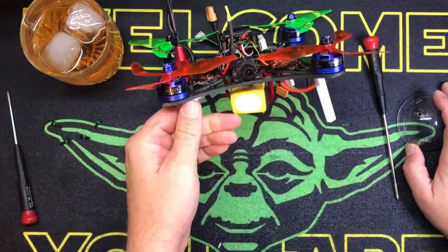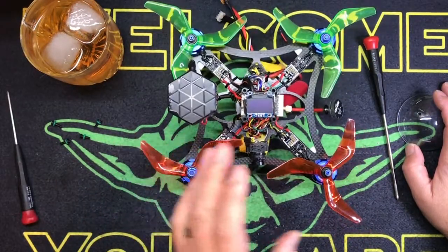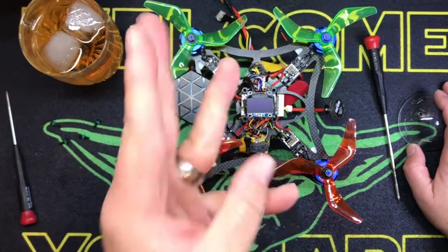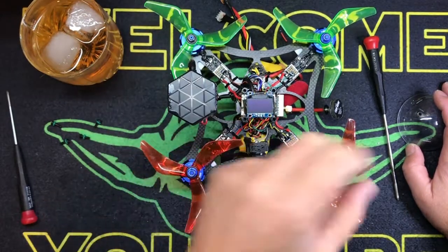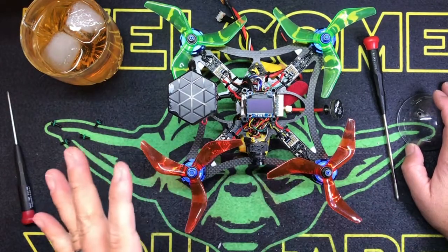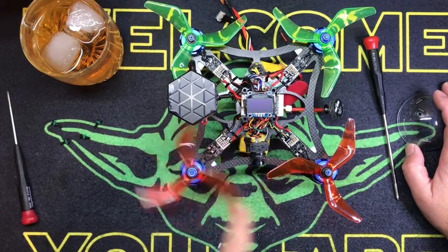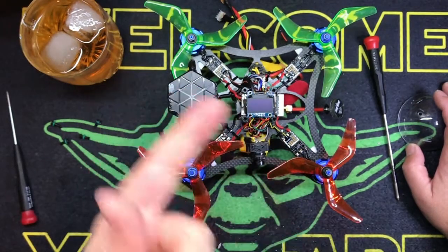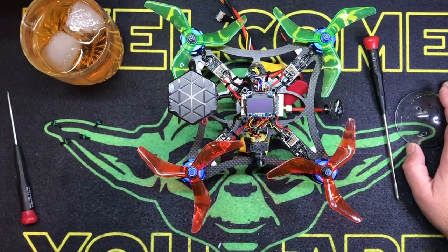He's not the most efficient drone for flight time. But that's okay because EWAD, which stands for Extreme Weather Aerial Drone, I built so he can fly through snow, rain, and high winds. He has high KV, 2600 KV motors, 5-inch props. He can slice through about anything. In that video I did the other day where I went 4,000 feet up in the air, there were 15-mile-an-hour winds out, and he handles it just fine.